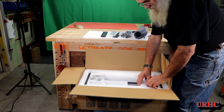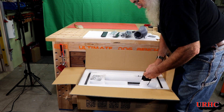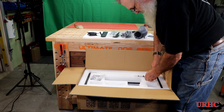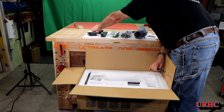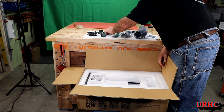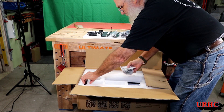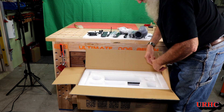In a tight house, that's not such a good idea — you can actually pull fumes back through your appliances. You really should have a nice controlled way to vent them, and you also have to look at your house, because in newer tight houses you'll need to make up for the air that comes out. This enclosure looks like it's got a nice airflow that'll be just right.